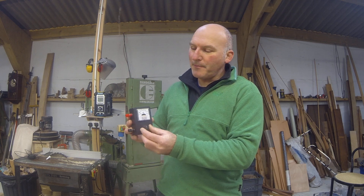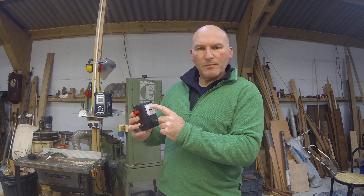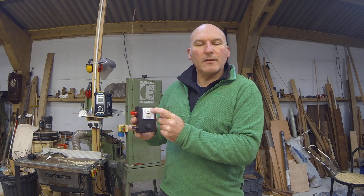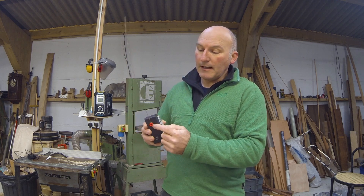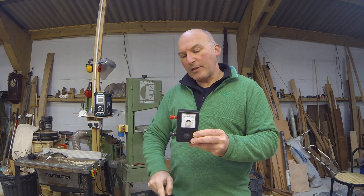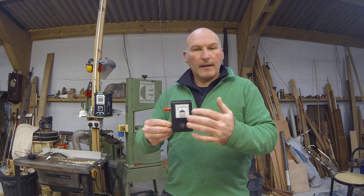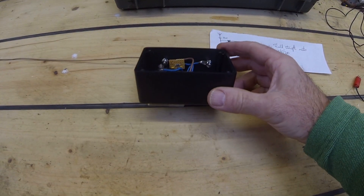You can turn the sensitivity down and the needle will come back and it won't read as high. Although there are graduations on this meter, I just use them as an indicator of what I'm doing. It might come up to 60 on here - that doesn't really mean anything, it's just a graduation I'm using as a reference. This particular design also has a ground pole so I could put a counterpoise on here, and my body acts as a capacitance to improve sensitivity.